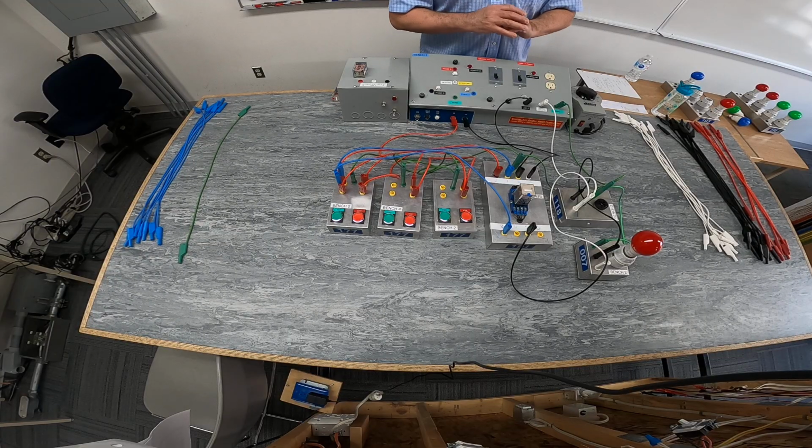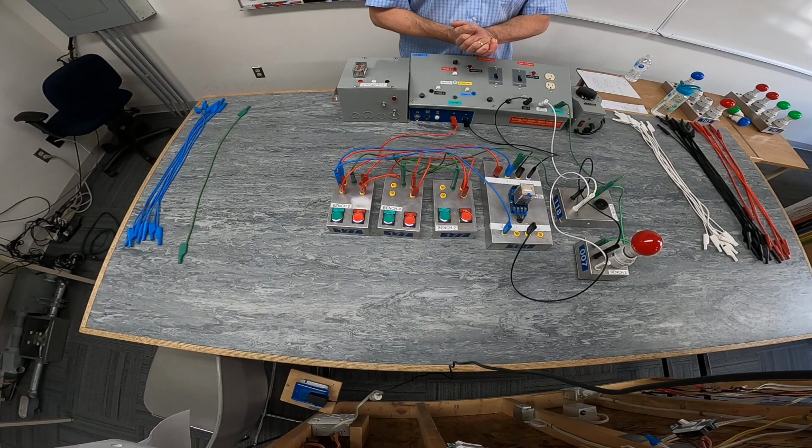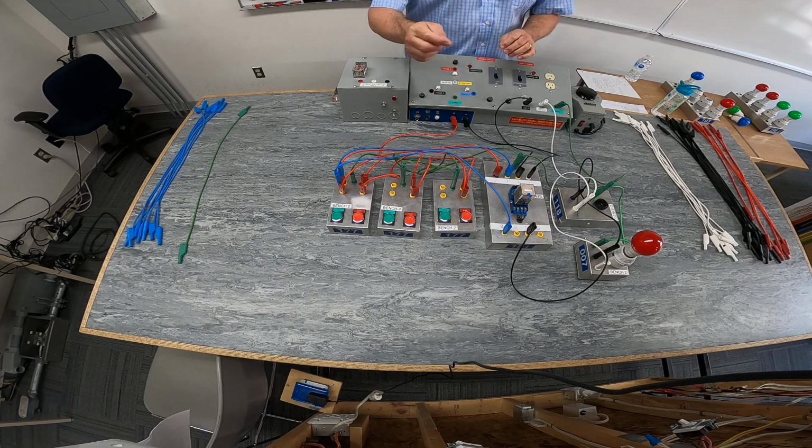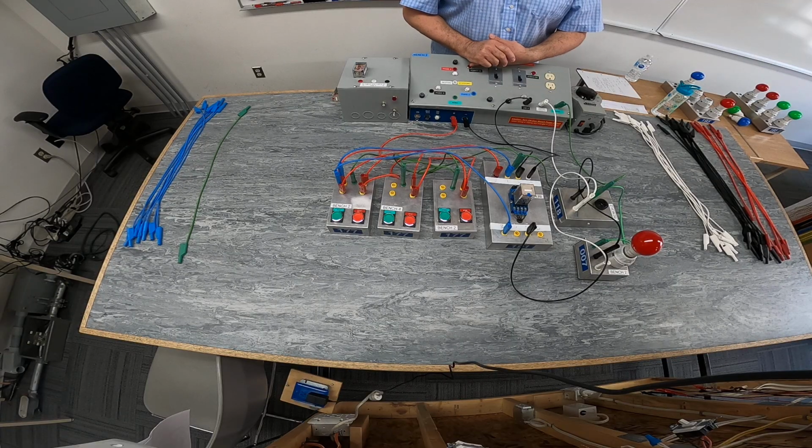The more information you have on your schematic drawing showing terminations of all this, then when you finish writing your schematic drawing, you can go with that schematic to real world physical connection, and you can verify each wire is going to the proper terminal and connection.